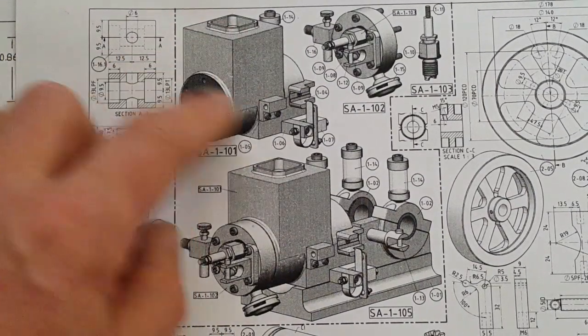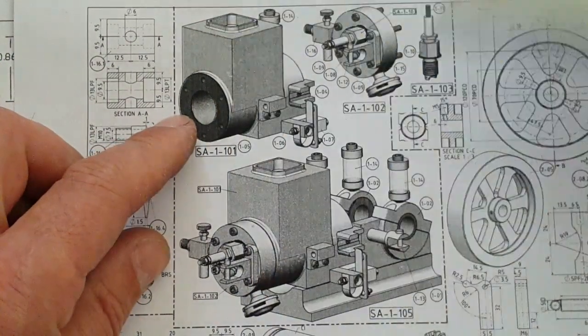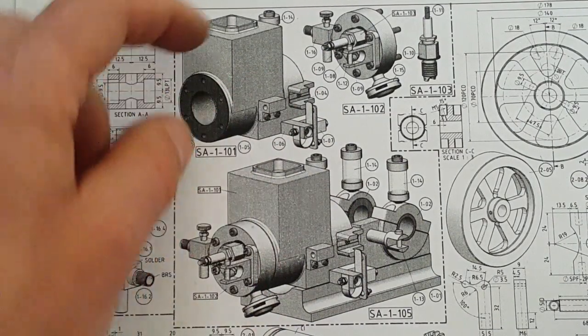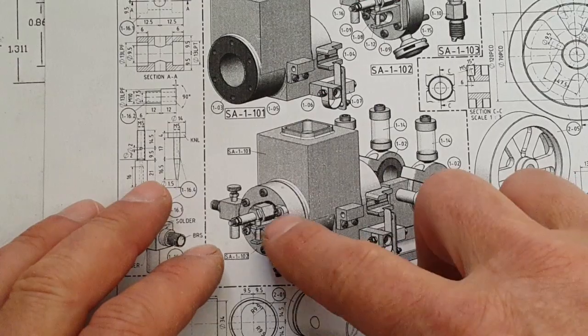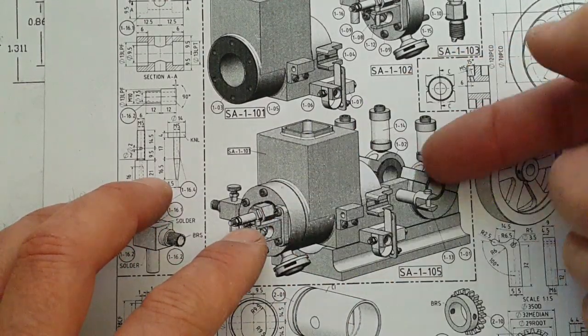Here's a 3D picture of what we're going to be ending up with. It's going to be made out of this piece of stock and we've got the cylinder running straight through the middle, so we're going to have to bore the middle out here. Then we've got the water jacket here and we're going to have to machine into the water jacket as well to meet the cylinder. The cylinder head is going to sit on this end and then obviously the piston comes in and out this end.